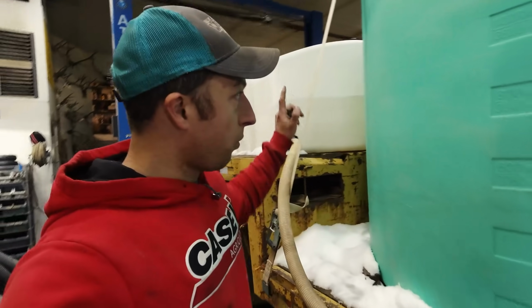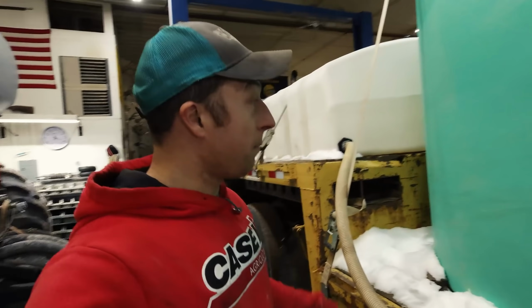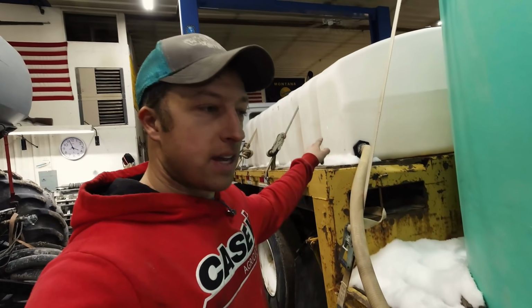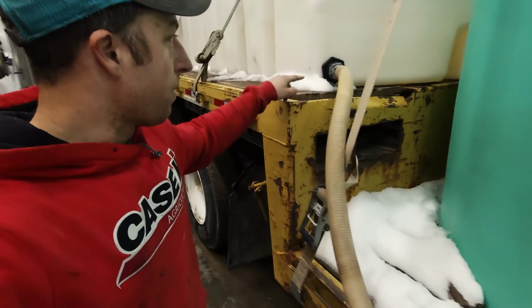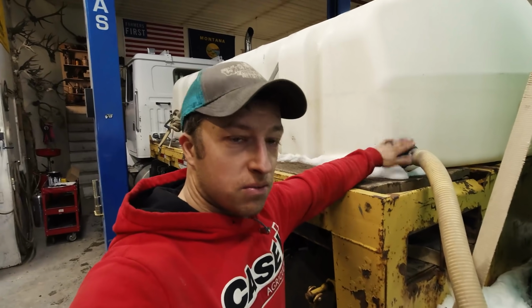Because by the time you start pulling out of that tank, because this tank's gotta get below that tank, it gravity feeds pretty slow in. So I'm gonna tie a 3-inch into that, and the 3 is gonna run down in the whole system. That'll really help speed up the pace, as well as filling that tank fast. So I gotta take all this off right here. I'm gonna plug this line, go into this tank, this 2-inch line, and I might ream out this hole and put the 3-inch here. I haven't decided yet. So let's start figuring this out.